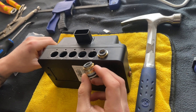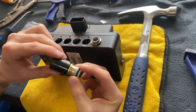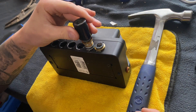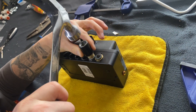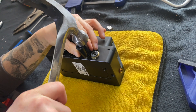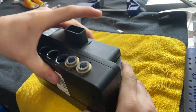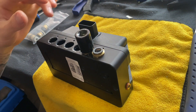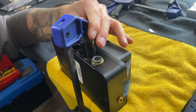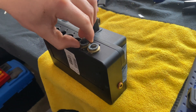To put your new cartridges in, if you have three-eighths lines, you'll want to use a 16mm socket to slide over the plastic so that you're actually hammering on the metal. You don't want to break that piece — just slowly tap it until it's in. Then, to make sure it's a good seal, put your socket over the top, get a clamp, and clamp down on it so it gets pressed in nice and solid. And that's it.